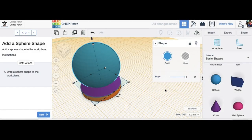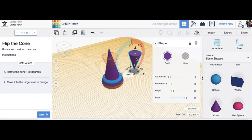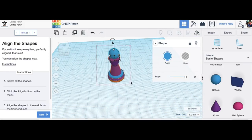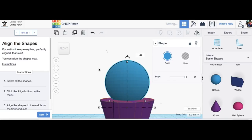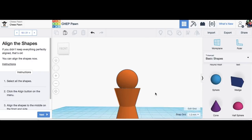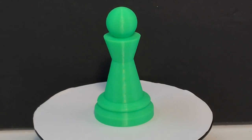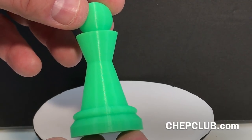I did this for every piece it asked me to drag in and drop, so each piece was smoother and you could see it was coming out better. Step by step I built the pawn, and when I brought the top ball in it told me it wanted 8x8x8mm, but I made it 10x10x10 because that's what made it my pawn — I thought that looked a lot better. Once I had it all lined up I grouped it together and I had my new CHEP pawn. You can just look at it and see it's so much smoother. I downloaded that STL file, used those same settings in Simplify3D on the CR10 mini, and you can just tell this thing came out so much better. Even when I spin it on its side it's hard to see those segments reflected in the light.